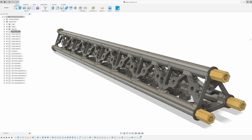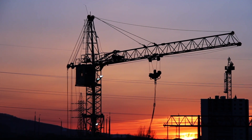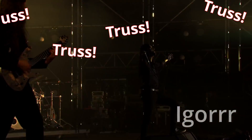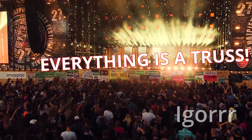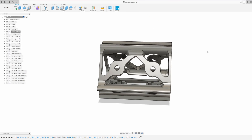If you want to make something light and something stiff, you'll end up with a shape that sort of looks like this — what you also see with cranes. In my case, I got the inspiration from a truss. A truss is often used to build stages and these are very stiff and lightweight. The truss consists only of triangles. The design consists of these individual segments, and they are just mounted together with these threaded rods. Maybe we can turn this into a whole ecosystem — like a system design, like Legos.